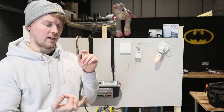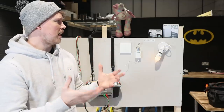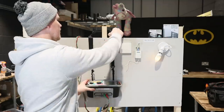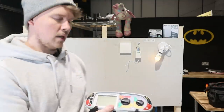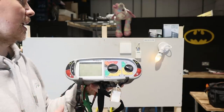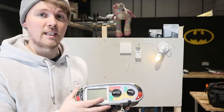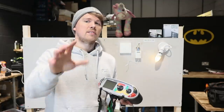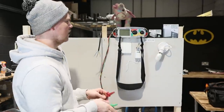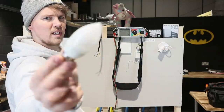Rules for smart switches: you can connect them to Alexa, Google Home, your phones. You can get dimmable versions, there's loads of different bits. But I've read the instructions and I can't see anywhere it says do not 500-volt test it. So what we're going to do on the Megger 1711: we'll do it on 250 volts first — which really isn't going to do much — test it, then go onto 500 volts and give that a test. We'll do this all without the lamp in first.